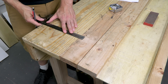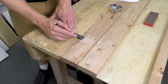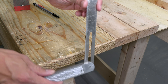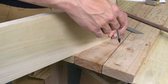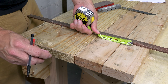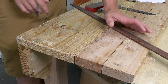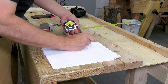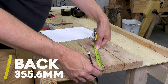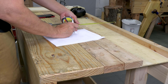My stock is 5.5 inches wide, so I'll make that the width of the sides. I'll run a vertical line — that's the back. I know I want a sloped lid, so I'll find an angle that just looks good and lock my bevel gauge. I want all the parts to have the correct thickness, so I trace a piece of stock for the lid. Then I find my final length for the back, adjust the line, and draw in the thickness. I'm not even using a ruler, just a scrap of wood. From this basic sketch I can measure all my components. My back is 14 inches long, the lid is 7 inches long with some overhang. In a few minutes I'll have a complete cut list.